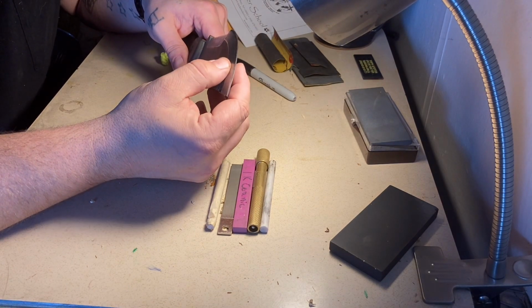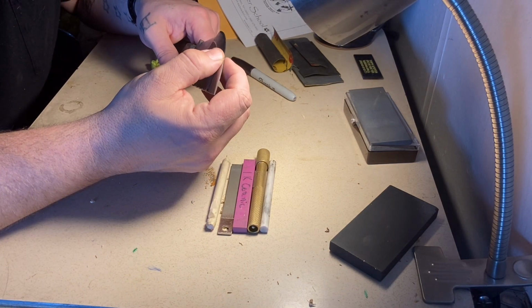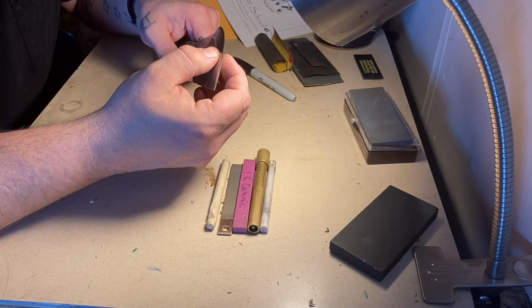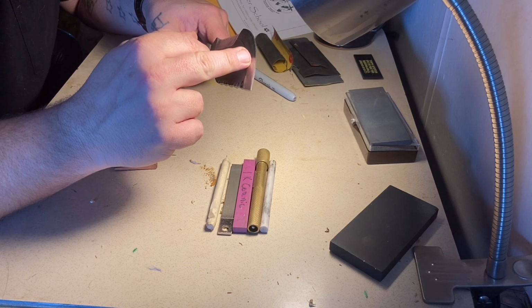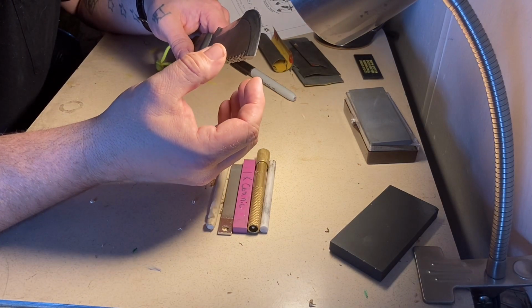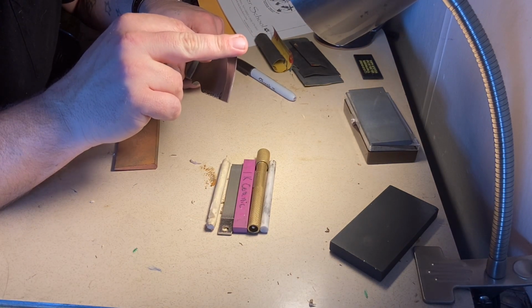So this primary grind, you can see it's just pretty obtuse, but it comes down to an angle. The angle here will get thicker as you sharpen back. So as these edges drop back into the primary, this part of the edge gets thicker and thicker, because this is ground here, and then they go to the secondary grind and grind again.